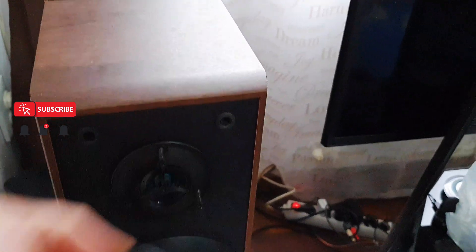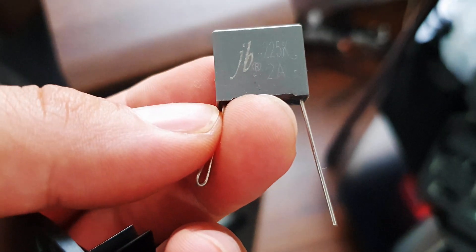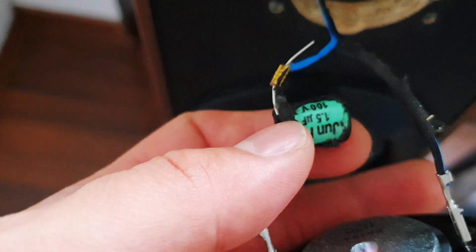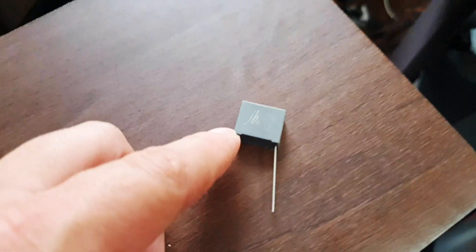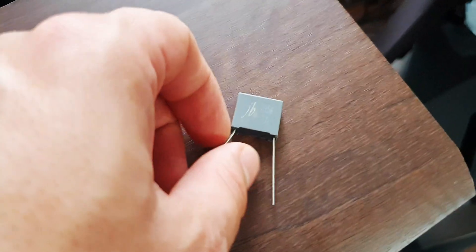I will try to make a hole directly here, vacuum the dust, and put this tweeter in. We will use a high quality capacitor of 2.25 µF. I unmounted this Sony tweeter — it has 1.5 µF — and this new one is 2.25 µF. It would be great if I had a capacitor of 5 µF and 1 µF, as that would split the highs perfectly.